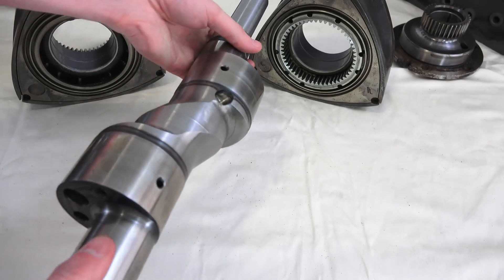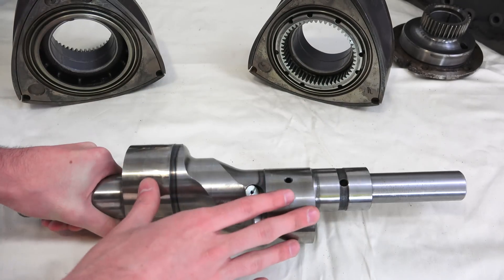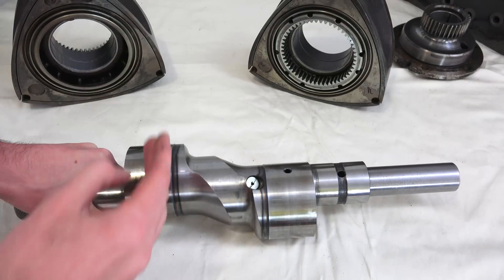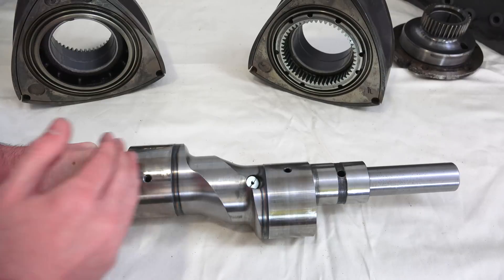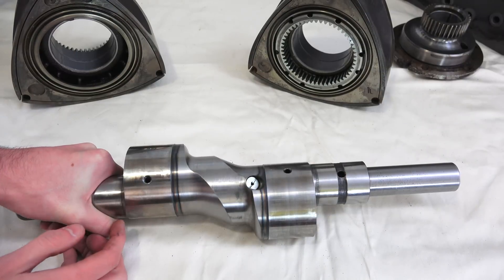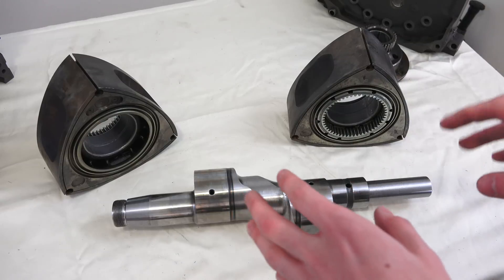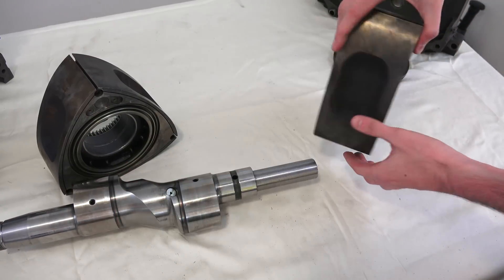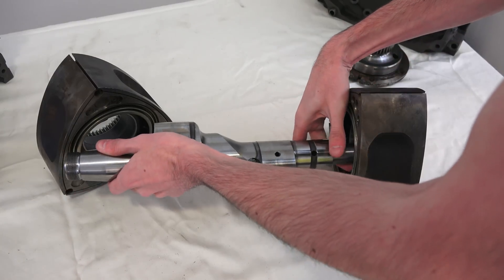It's going to be well balanced, rather than being offset and unbalanced. You will still have a moment occurring because you've got one rotor going one direction and another going the other direction simultaneously. But because all of this is rotational and because it's balanced vertically along the axis, it's going to be a very smooth, very low-vibration running engine.